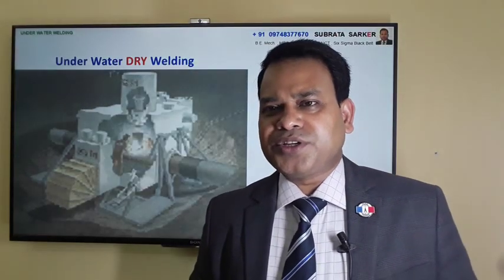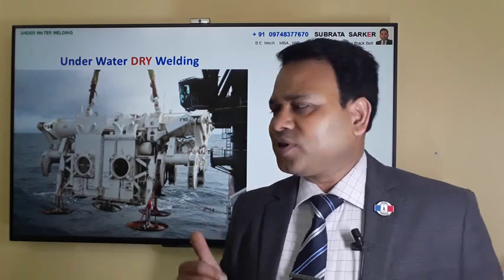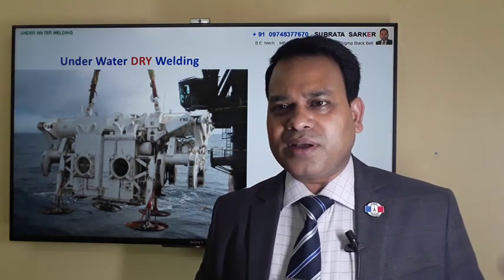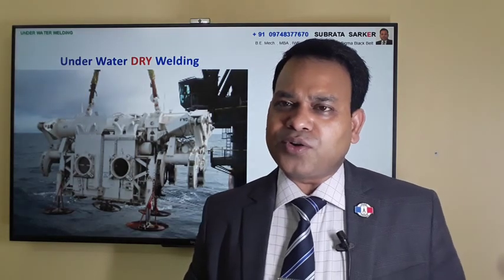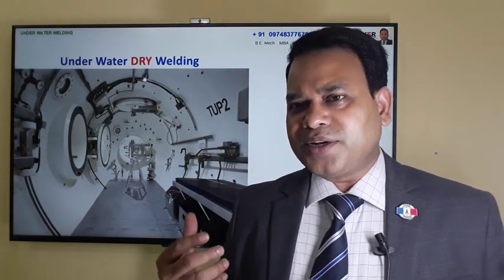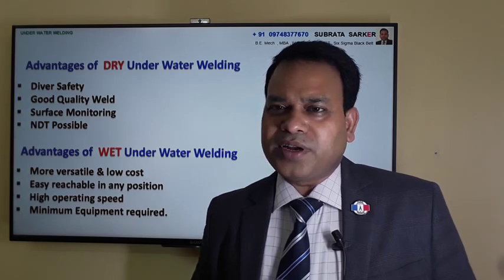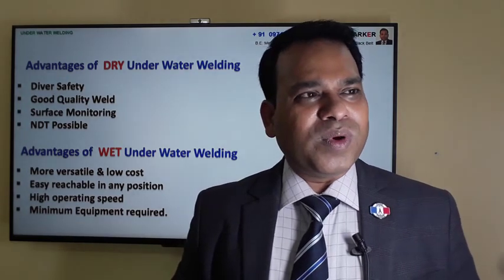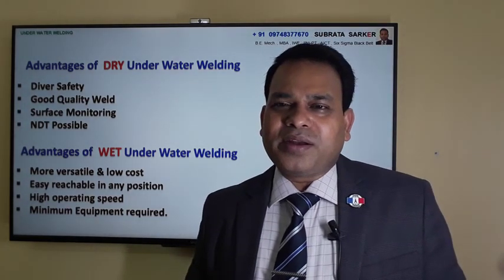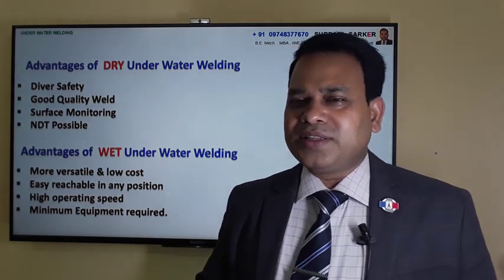You can see in this picture one real piece of equipment used for underwater dry welding. This is a modern system where people can be inside the box, and doing welding feels like working in a room. In dry welding the welder is safe, but it is a very costly exercise. In wet welding the welder is not very safe - there is every possibility of accident, electrical shock, explosions, and health and life hazards - but the equipment cost is much less.